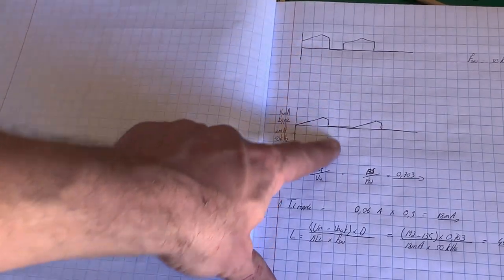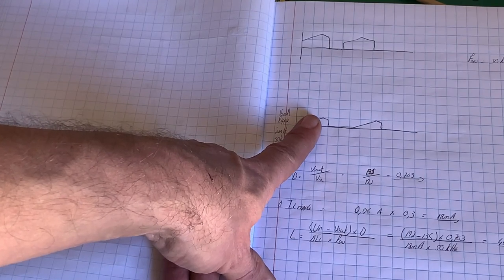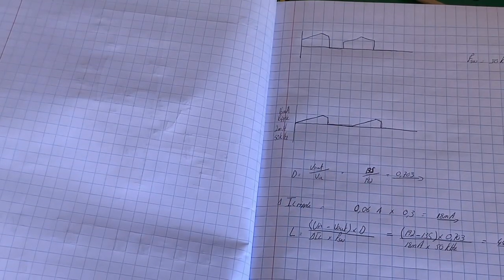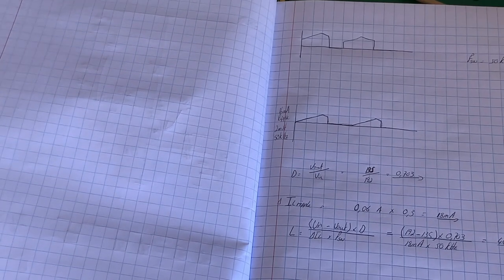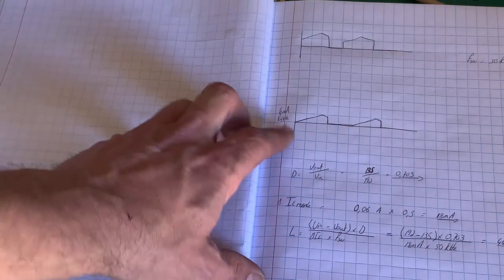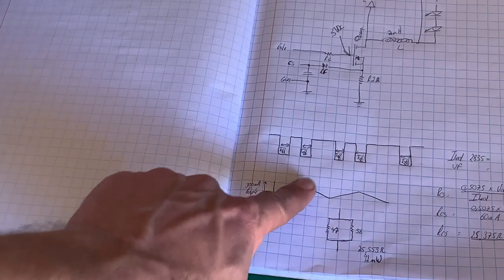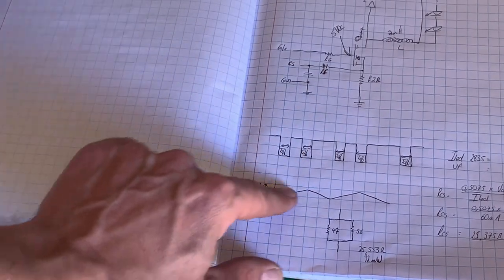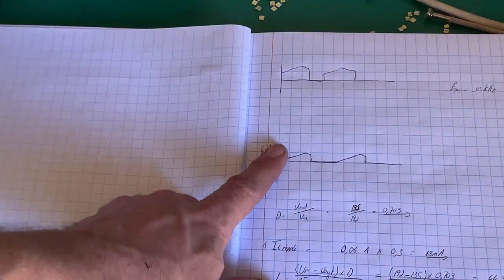Currently, we have a 2 millihenry inductor in there, and that is definitely not going to handle our ripple current. Typically, we want a ripple current of 30% of our rated current going through there. So if I'm going to pull 60 milliamps, 30% of that is what I want to be my ripple. In other words, from the peak to peak, the ripple must be 18 milliamps. That means the inductor is never going to zero and we have a constant current. Our problem being is we only have a 2 millihenry inductor in there.